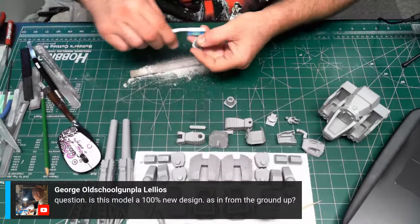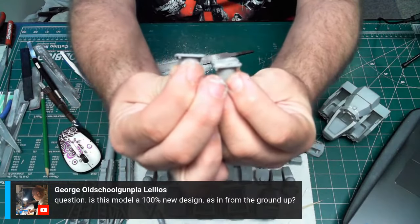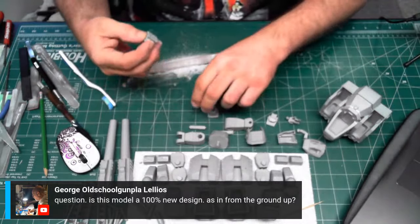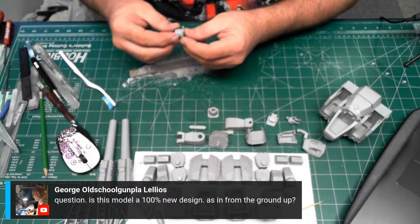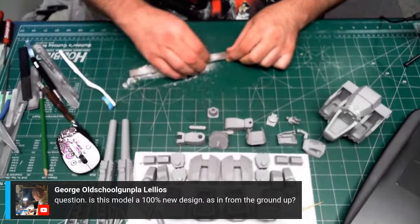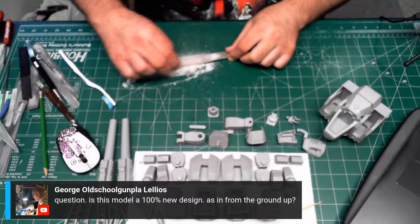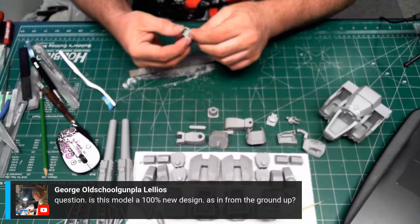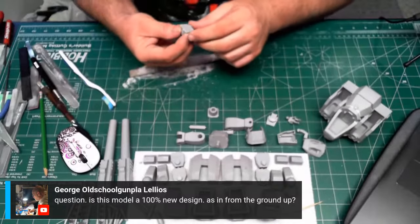Oops. So we're almost there. You can see the difference between before and after. That's after, and this is before. So there you go. Quite a bit different. Almost there, I can see a little bit of where they poured it in, still there. So I've almost gone completely flat. Once I can no longer see those, you just see the wavy lines of the resin pour. Once that's gone, I know I've gone far enough down, and it's really close right now because it's getting to the point where I'm seeing only the square plate.